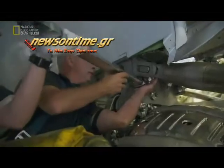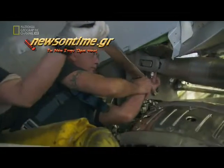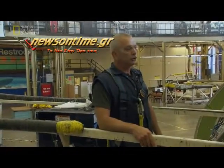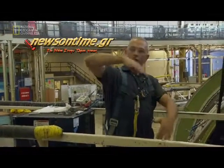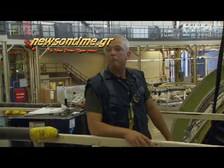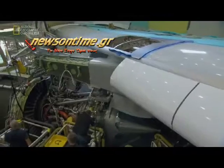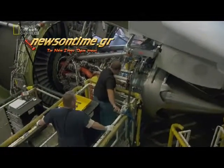Okay. The torque on those bolts is 625 foot-pounds on the rear, 375 foot-pounds on the front. The fronts are designed to shear off. That's per design, in case there is any problem, so that the engine will shear at the front, fall back, and break away from the plane without taking out wings or flaps or any of that. There's one. There are 3 more engines to mount. Once again, the crew will need to burn the midnight oil to get the job done.